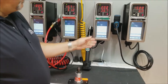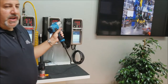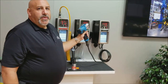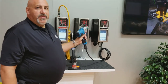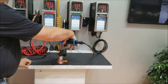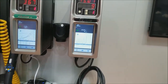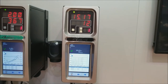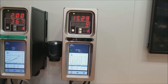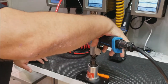Finally, we have the IPC controller — this is for an electric pulse tool. Same principles of operation as the pneumatic, except this one operates with electricity directly corded out of the controller. One-hand operation, no torque reaction, and high-speed tightening results. You'll notice we're demonstrating the curve, which shows us the number of pulses against the torque value being achieved.